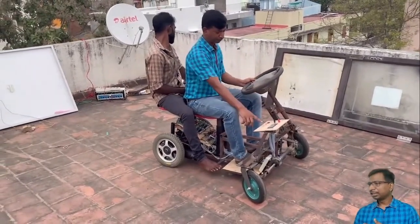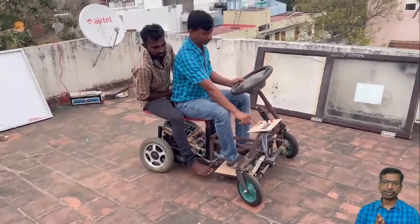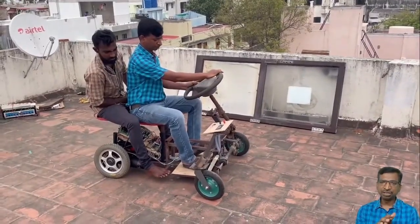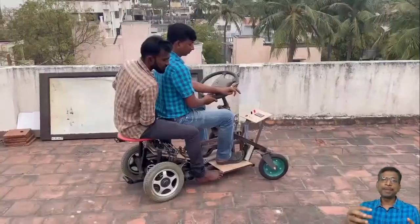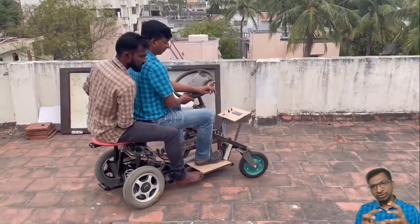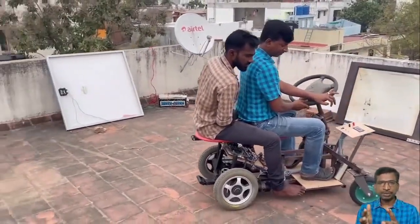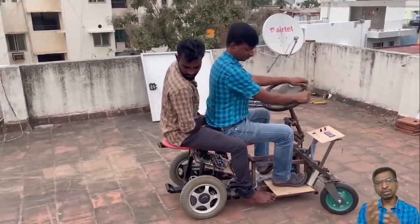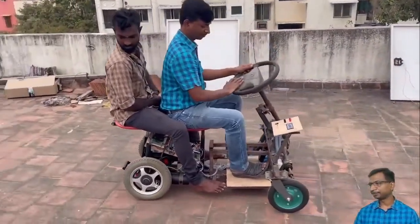Tej Kumar asks about regenerative braking, charging the power also. Yes, that is also possible. For implementing regenerative braking, instead of approaching zero speed, you can apply an electronic load. In that case, again you have to put a DC to DC converter along with a supercapacitor. After the supercapacitor, you can transfer the power to the battery. That type of option you can implement.